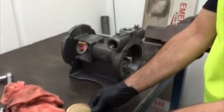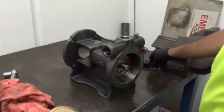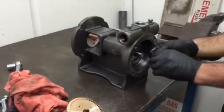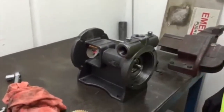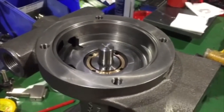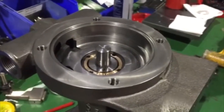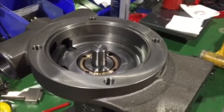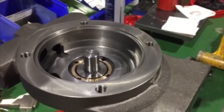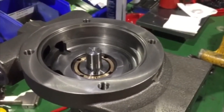Remove the key from the pump shaft. The simplest way of removing the seal is to remove the entire quill assembly. Sometimes this is not practical as you have to remove the coupling cap and the coupling key from the shaft before you can withdraw it from the body.